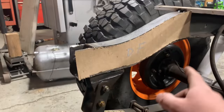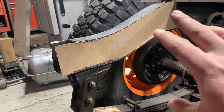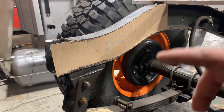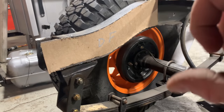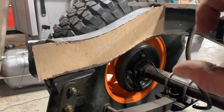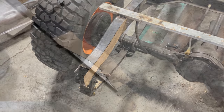There's my template for the first piece I'm going to do. On vehicles I would say always do driver and passenger, and still left and right, because you can still get confused. I just cut it out like a gasket — this is some poster board kind of cardboard. Tap on it, cut it out like a gasket, gives you a good silhouette, trim it to fit. It's a little bigger than it needs to be right now, which is good. This kind of stuff you might as well just cut it a little big and then grind it into fit. Alright, let's go get this first piece of plate cut.